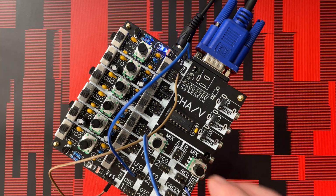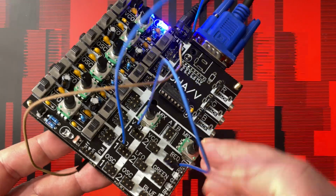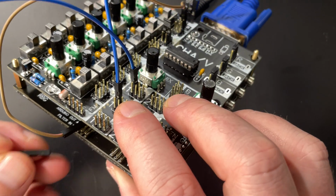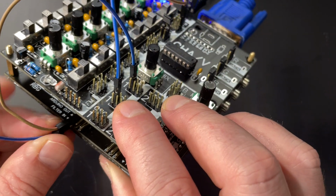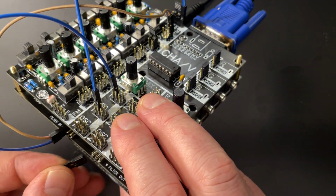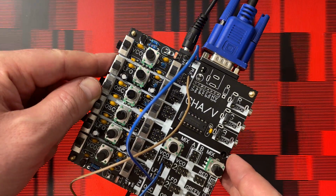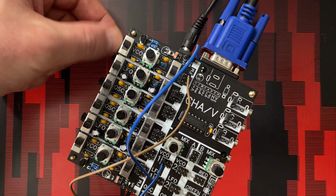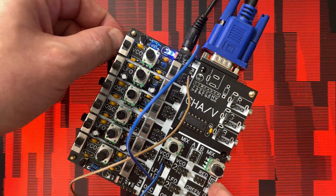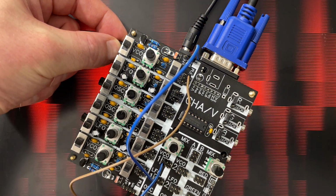We could also do something like, now that this is all opened up, take the output from that VCO, and instead of plugging it directly into red, we could put it into the filter. So let's put it into the filter. Might as well use red because it's open, but again, that's sort of arbitrary. It could be anyone. And then I'm going to jump red to the filter output there. And yeah, here it is as an attenuator, right? Just turning down smoothly. And here it is as the filter. We're in filter mode now, and we get these kind of soft edges.